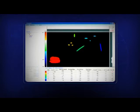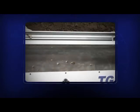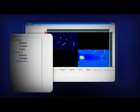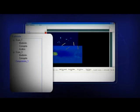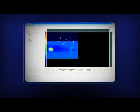Any defects found having a length exceeding the scanning length are assessed by moving the scanner to completely cover the defect. The software allows overlapping measurements and combining them as many times as required. The images from every measurement are taken from the tree and the overlapping point is identified manually. As soon as overlapping is obtained, correction and analysis are conducted.